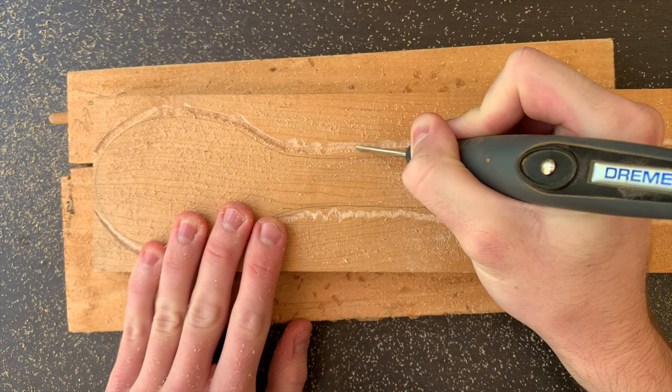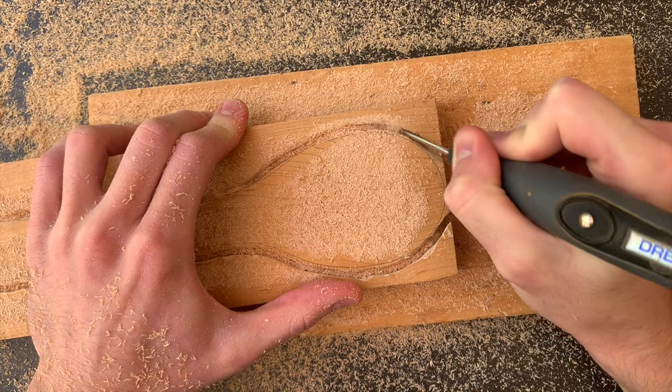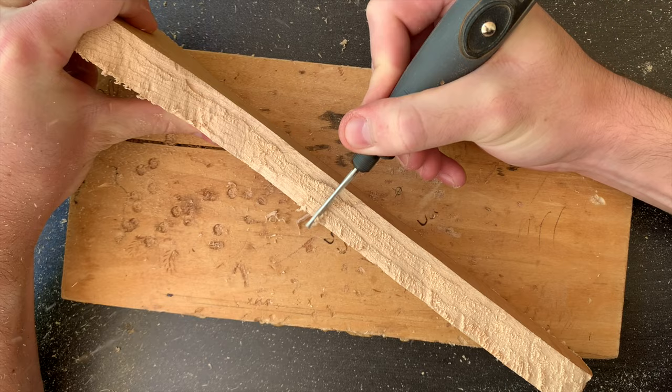This is a hard and thick piece of wood so I did several passes until I got the outline out. You don't need to be super accurate here — we're just getting a really rough 2D spoon for the time being. Now that it's out, I stick to the 561 to shave away the sides and clean it up a little. Always carve right to left with the 561 for better control.